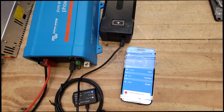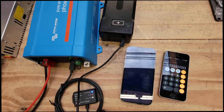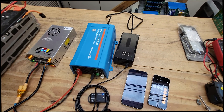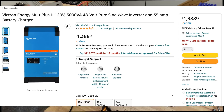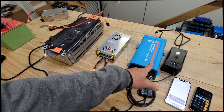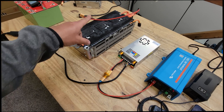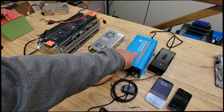Around 40V, divide by 12, that's about 3.3V per cell — that's when the inverter will start working again. This inverter doesn't have a ton of features but it has enough to be usable with the Honda Clarity batteries. They make bigger ones too, up to 4 kilowatts. You could parallel a bunch of these batteries, put them in a cart, connect a solar charger that charges up to 50V, and you'd have an inverter system that uses 100% of the battery.